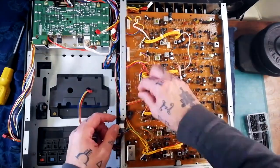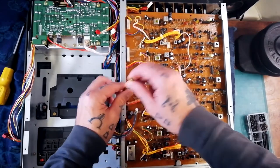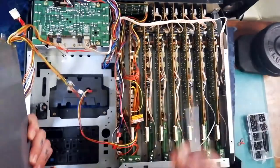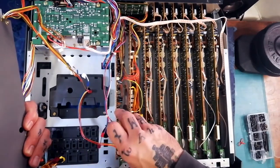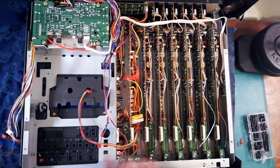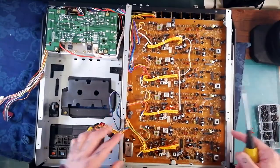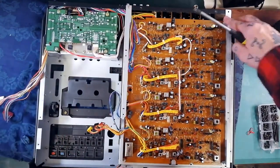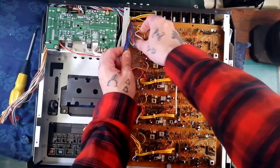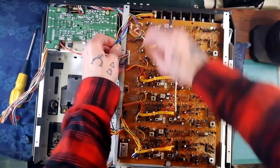Note I'm editing this in out of sequence: when you first open this there's probably going to be one extended screw going through a hole in the record playback amplifier board, using the same standard screwdriver as the others but passing through that board into a hole beside where I'm tapping. In my case I've used a normal screw instead — it's part of how these two boards are secured to the chassis. The record playback board is typically connected in four places, and you may find cables have cable ties and are tucked under the metal bracket; there are two large headers here.